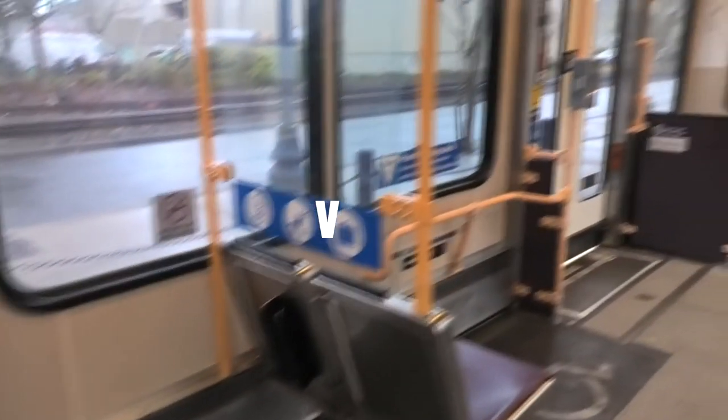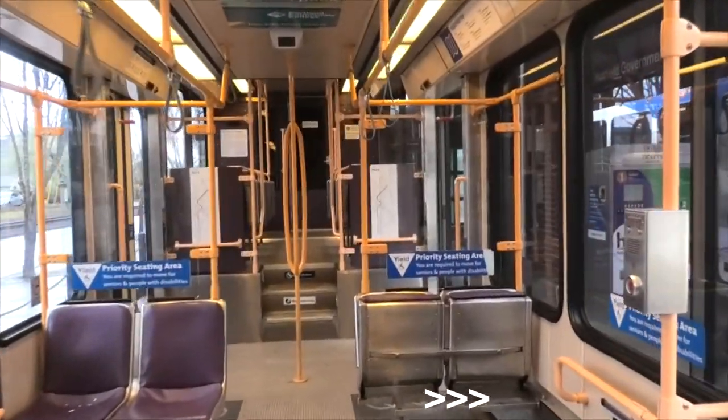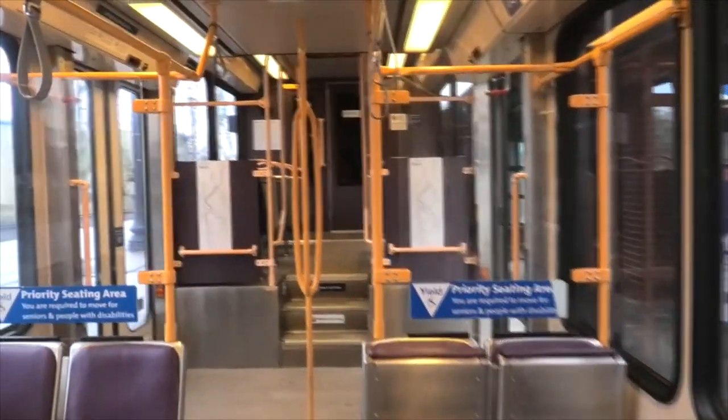Those return vents are only for use in the summertime when it's going to be cooling the train. The Type 1 and 2 Max cars have a very simple system — it keeps the train at 68 degrees all year round. The Type 2s also have a nice feature which introduced baseboard heating, and those kick on if it's below 55 degrees outside, with a set temperature of 66 degrees for the inside.